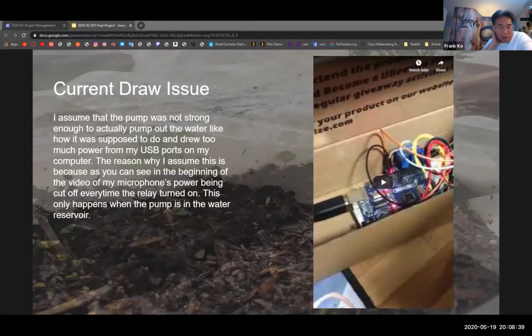If you recall how we were able to demonstrate that, I used a separate 120 volt line source, ran it through the output of the relay. The input of the relay was controlled by the PLC. The output of the relay that does the contact closure on and off was not powered through the PLC. It was powered through a separate AC rail, which upon opening and closing as it's programmed, turned the lights on. So the same thing could have been done here.